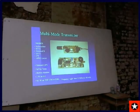very interesting device that uses a Cypress PSoC instead of, I do like to use the Atmel series, but for a Cypress PSoC this time. It has a lot of mixed mode capability. So I can get upwards of a watt on HF and about 300 milliwatts on VHF with this. It's frequency agile. Depending on the output filter, I can put it anywhere from 80 meters all the way up to 2 meters.